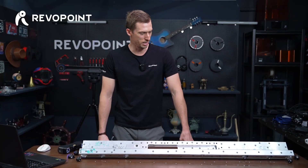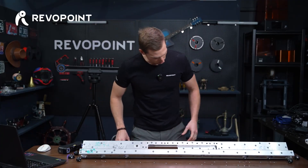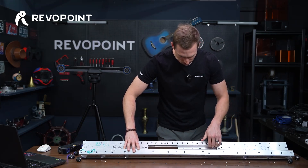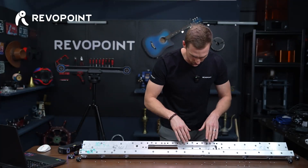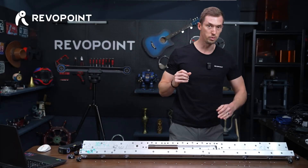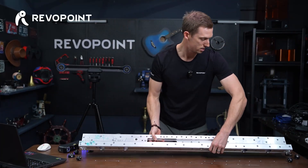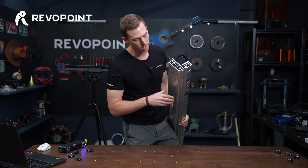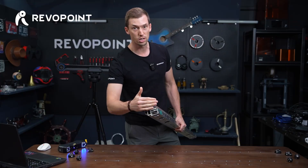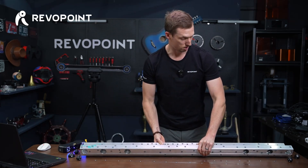Here we go for the second portion of the scan. Ash just got finished with the one side — I just flipped it over. There are certain parts I want to draw your attention to. Obviously here I need to spend a little more time at that crevice, making sure I capture it well. I'm going to really adjust my angle to capture the point clouds from all areas. Because we're going to be merging these two pieces later, make sure you really spend some time on the ends, because the ends actually have some feature-rich areas that you can later connect. See these little rectangles and squares? Get a good point cloud capture of both sides so that it will make your merging that much easier later.